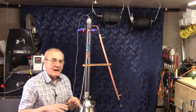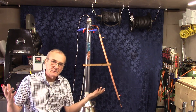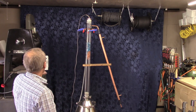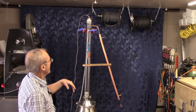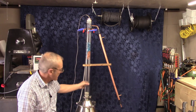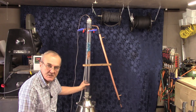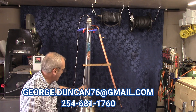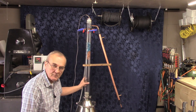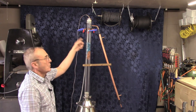Now that I've got this thing set up and started, I set it at 128 degrees — that's where it was set — and I've got this 3500 watt heater heating this up. Right now it's measuring 71 and you can see the steam starting to build up in the bottom of this column, telling us vapors are rising and condensing when they hit the cold column. We're going to let that run until we bring it up to temperature, balance the column with the kettle through the PID, and then start the water flow.